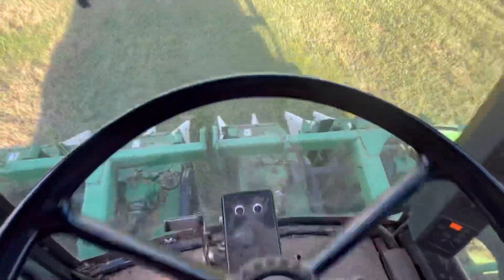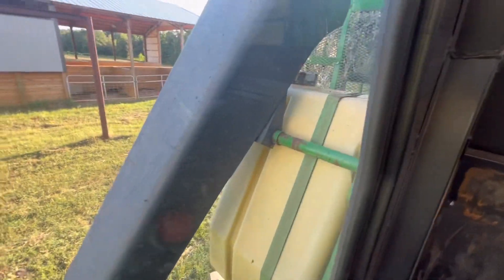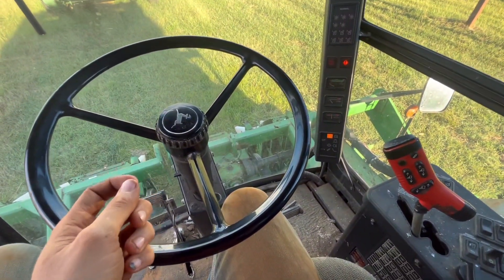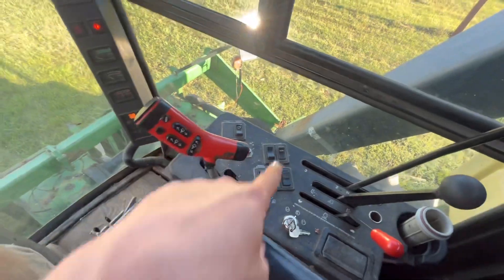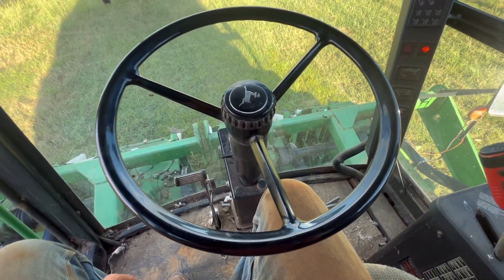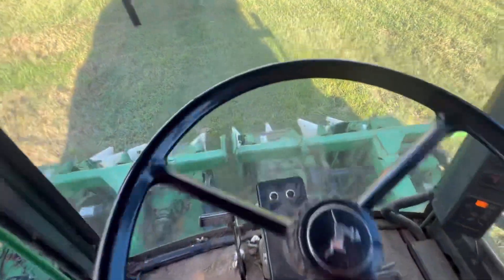It's easy to be intimidated by all those moving pieces. You see the lube button here and this tank — the soapy water goes in the tank on this side. You also have what they call spindle grease; it's really thin, almost like corn head grease or kind of like lard. You pump it in this tank, and then every six hours of run time or so you hit this lube button and it lubes all those bars. Those bars have little gears spinning the spindles. Funny enough, you'd think cotton would pick up a lot of grease — but this is one of the greasiest machines you can work on because there are so many moving parts.